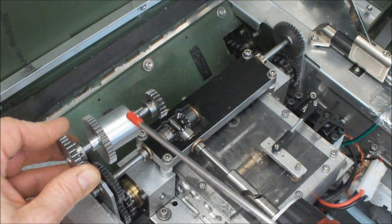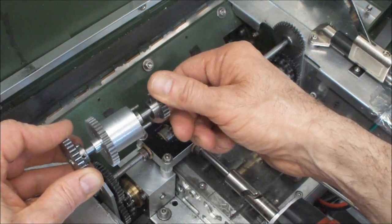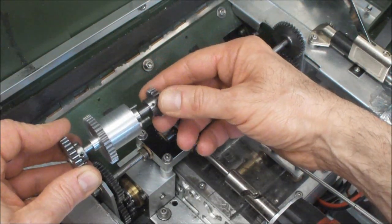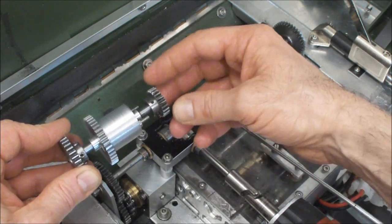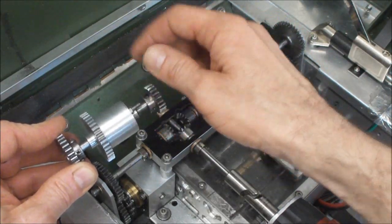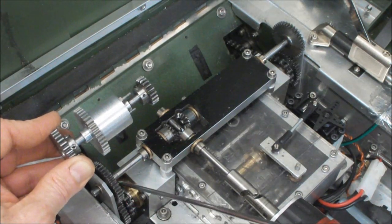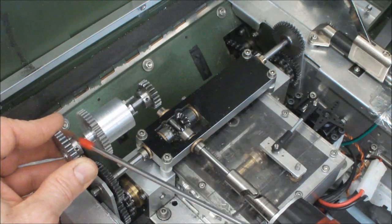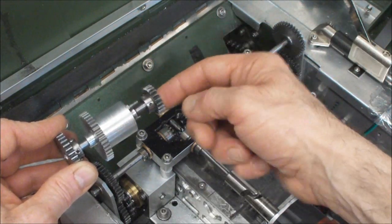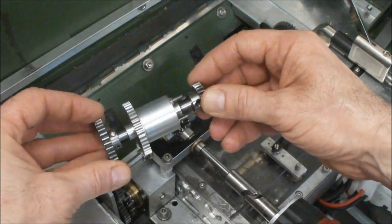This gear represents the chain gear, and this gear represents the control gear, or the second input shaft. Now, how a differential works - it's plain to see when you drive this gear: you move the differential housing, with a 1-to-2 gear ratio. This is continuously powered by the gasoline engine, and this goes to the chain gear to drive the tracks.